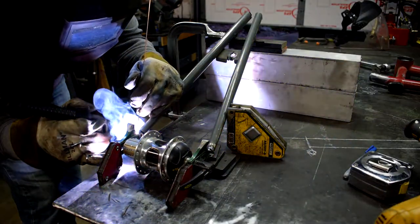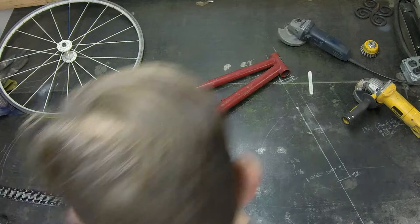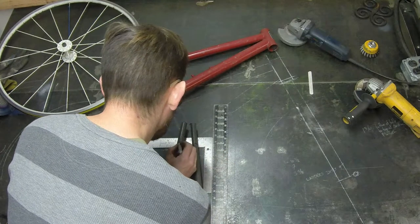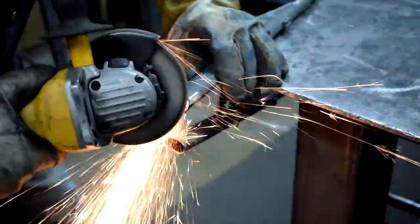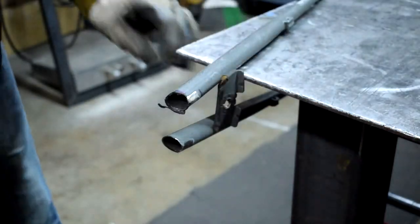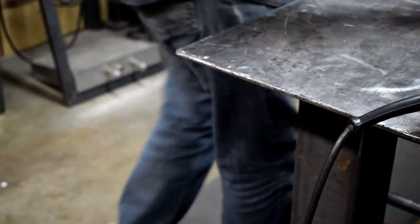You'll also notice that I'm leaving the bridge between the two braces intact — that just helps keep everything lined up while I'm modifying it. Next, I can transfer this over to the layout on the table and figure out where to cut the front part of the stays so they can be welded onto the bottom bracket. Once I've marked the lines, I can cut off the end of the chainstays and cope the end on the grinder so they fit perfectly around the bottom bracket shell. A lot of this is just taking your time, a little bit at a time, grinding it down. Once you think it's close, take it over to the frame and double-check your measurements, then come back and grind off a little bit more.